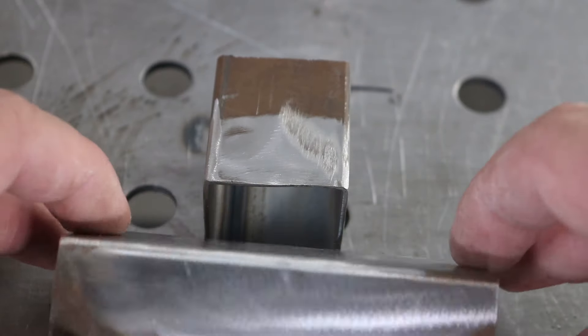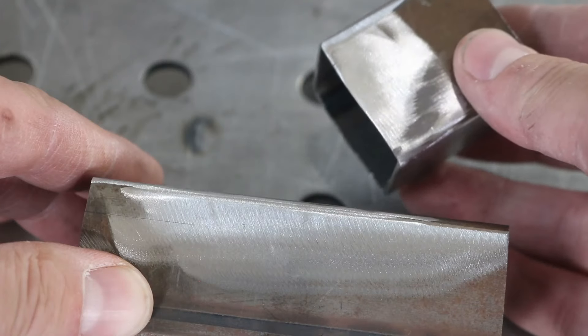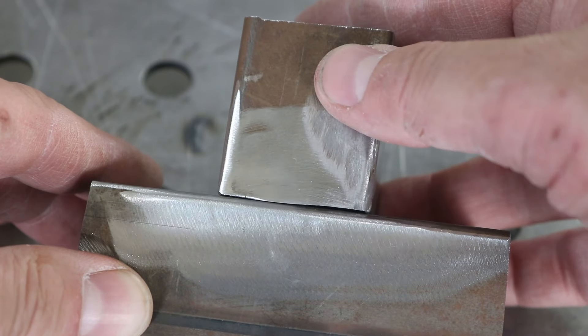For this demonstration I put together some test pieces — one longer piece of tubing and one short piece — and I'm going to make a T-joint. I'd recommend on just about any project to get a little bit of extra tubing and cut yourself some coupons so that you can get some practice in before you actually run your project.